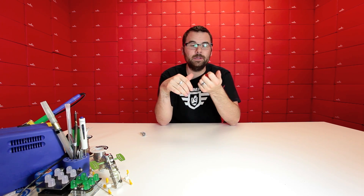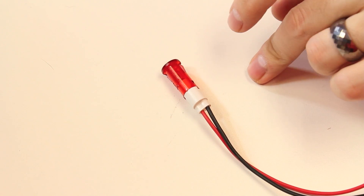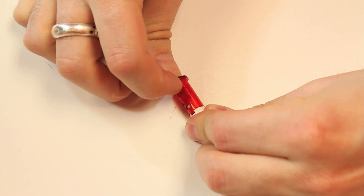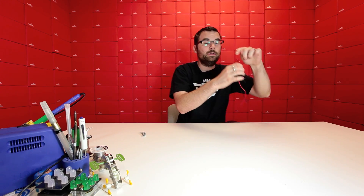We also have a few more LED things this week. First up, we've got this little indicator light — something you might see in the dash of a car, or put into a panel as a status indicator light. It does have an LED inside. It runs at six volts and should run fine at five volts. It has nice eight-inch long leads and these little springy clips so that if you drill the hole to the right size, you can just snap it right in. These are really great for panel mount illuminator lights if you don't want to mount an LED separately.